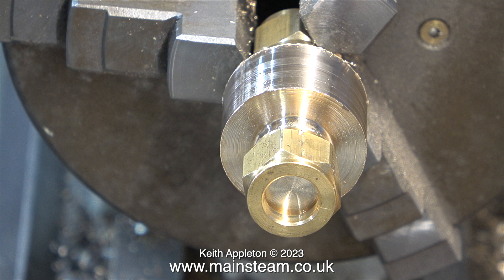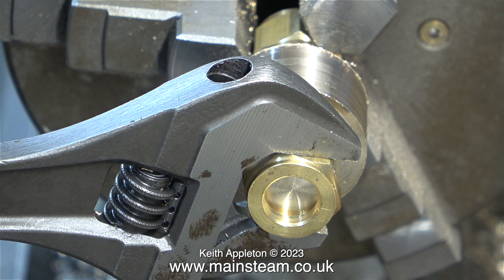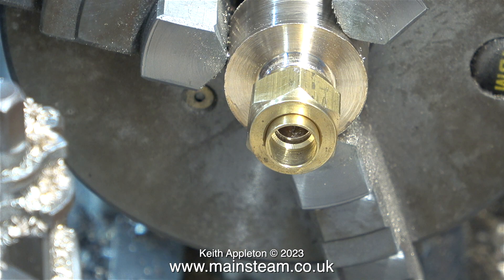As you can clearly see, I've threaded and fitted a union nut to this side too. But this time, to obtain the perfect length for the union nut, I shortened the threaded part so the nut went further onto the thread and looked a lot better. I needed to make the thread shorter to allow for the flange on the pipe union itself.